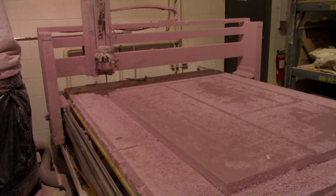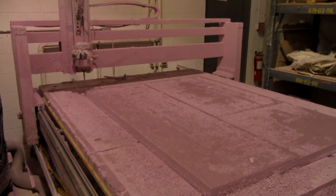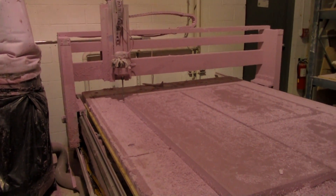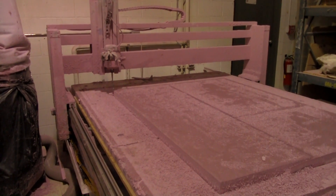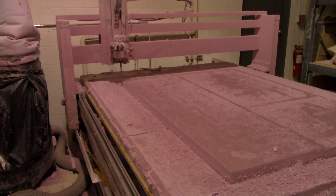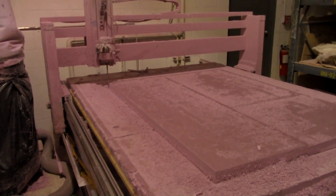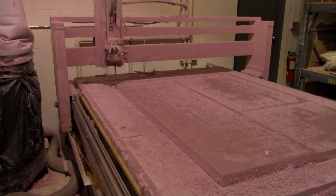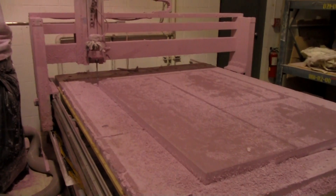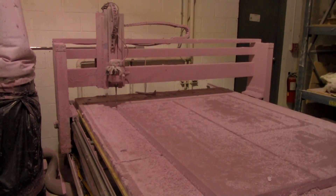Not to downgrade anything — you can still make accurate plugs, and I have — but the five-axis is just necessary for this type of work. We're going to have about 24 inches of Z-axis clearance that we can use with our fourth and fifth axis head to machine plugs. I'm not just going to machine plugs out of styrofoam; I'll machine a rough plug, then build up coats of putty — about a quarter inch of thickness — and then do a final re-machining on the plug. That way we don't have to go through the hard coating process manually, which is going to save us a ton of work I was never wanting to do again.